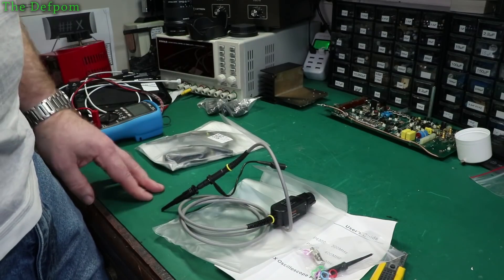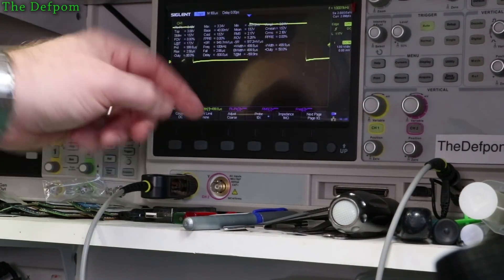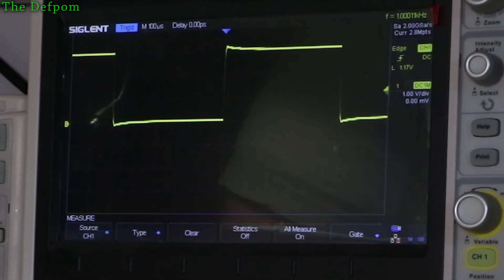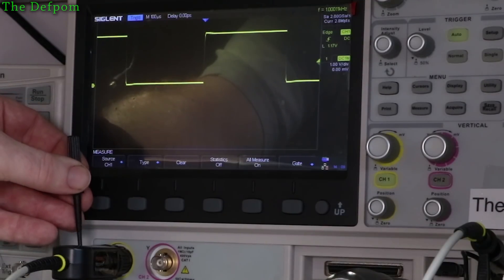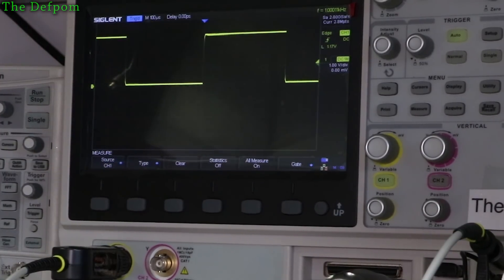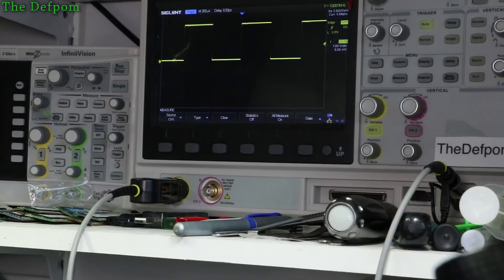I should really try this out. I've got the probe hooked up to my scope, going back to the probe compensation output, because I need to tune it first. Let's turn the measurement off. You can see there's a bit of a compensation issue here, as you'd expect, because I haven't tuned them yet. So let's get the little screwdriver out and give it an adjustment. It's a bit tricky to get that one right — about there. I think that's about it. I'll do the same with the other probe — it can compensate at least, so that's fine.